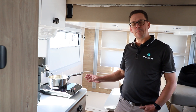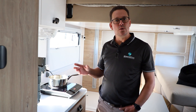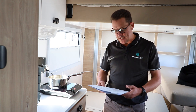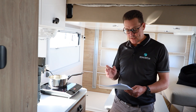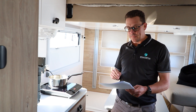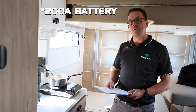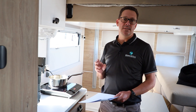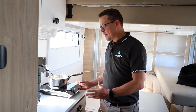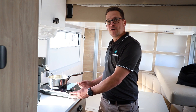Friends at Aussie Destinations Unknown and Trip in a Van have great videos showing real-world cooking current draws. One example we heard recently was cooking a mud cake in a Philips air fryer at 140 degrees — the perfect cooking temperature. It took 55 minutes and consumed 48 amp hours. On a 200 amp hour battery for example, that's only around a quarter of the usable capacity — a great application for inverters.